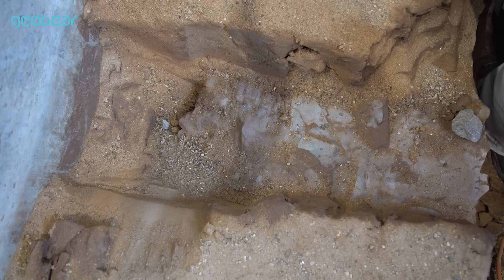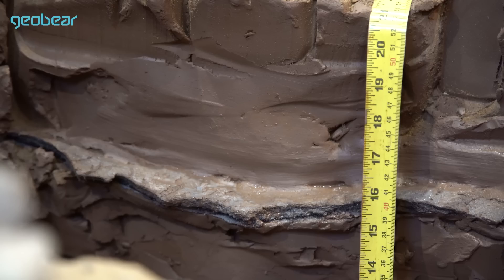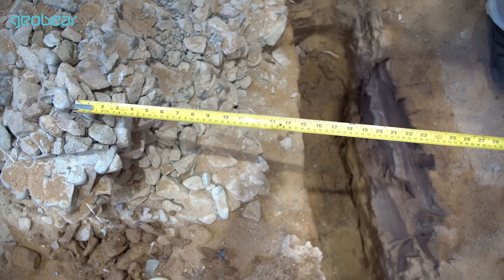The results are pretty much as we expected. The geopolymer created horizontal fractures through the soft clay material which are up to 15 millimetres thick, and we measured a maximum radius of 1.25 metres — so quite a large fracture zone filled with hardened geopolymer.